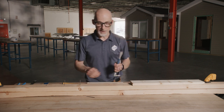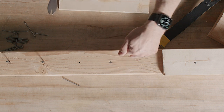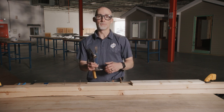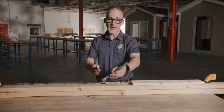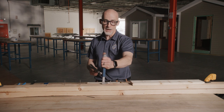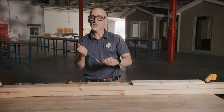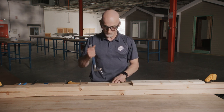The next one we're going to use is the cat's paw — one of my favorites. This is used to remove an overdriven nail. We have a nail whose head is below the surface of the wood, so I can't use the wonder bar on it. We position the cat's paw a little bit behind the nail head and strike it with a hammer, driving the blades into the wood and slowly changing the angle to hook the nail head. As you can see, it's not a very delicate tool — it causes damage to the material, but when you're doing demolition, that's exactly what you're looking for.